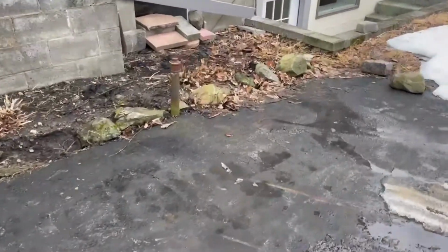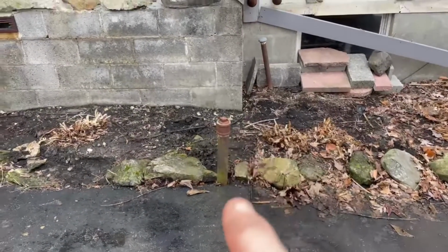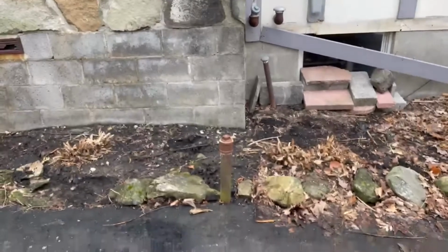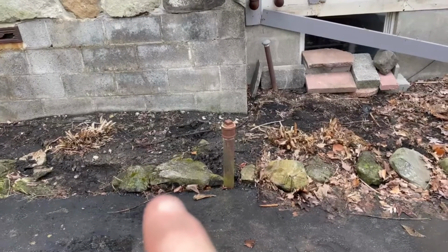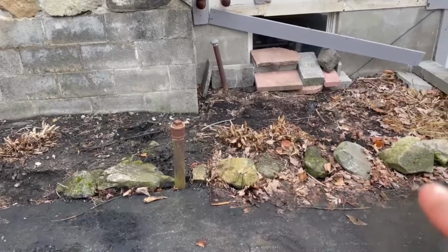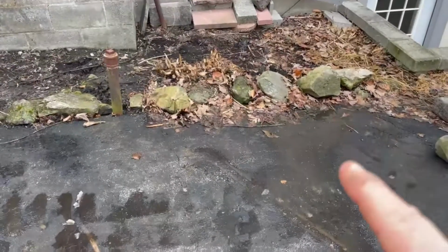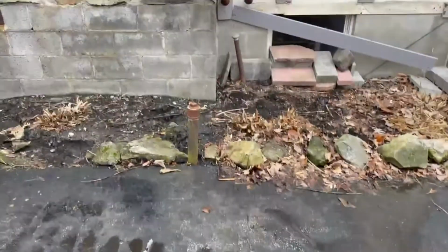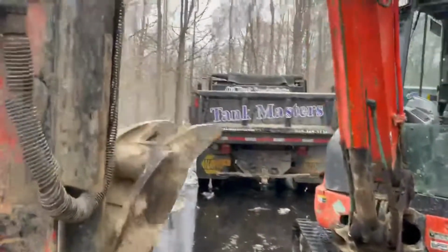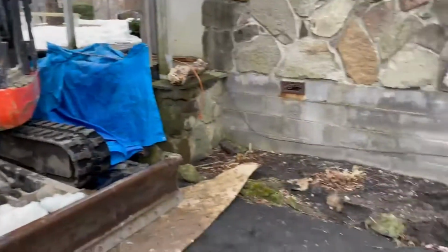Anytime the tank sits like this, the homeowner really doesn't know how it lies or where it lies to fill. That's the vent back there. Traditionally, the fill is going to be 8 inches off the end of the end cap. So considering it's 6 feet long, it probably runs down in here. So we'll remove those rocks. We'll get our demo saw, cut an area right there so there's a nice clean cut for when they replace it. We'll dig it right back into the Mason dump truck, the overburden, and we'll do our work and backfill from here. So this is considered a very easy job.